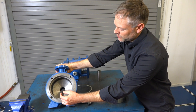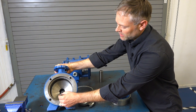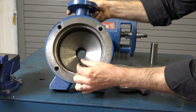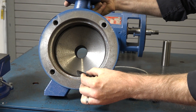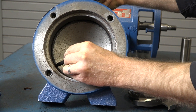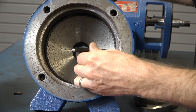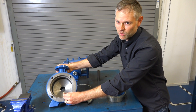When we look at the casing we need to check for excessive wear, gouging, or pitting on many of the hydraulic surfaces — that includes the front surface of the casing and anywhere internal to the flow path. ANSI pumps are designed with one-eighth of an inch wear tolerance. If you see a defect greater than one-eighth of an inch, the casing needs to be replaced.